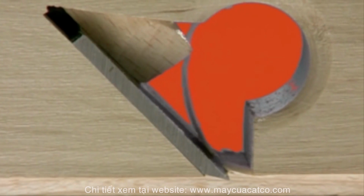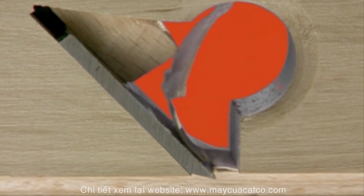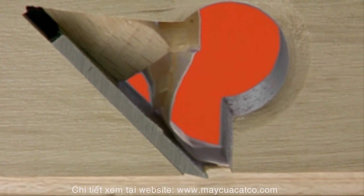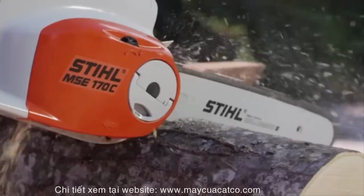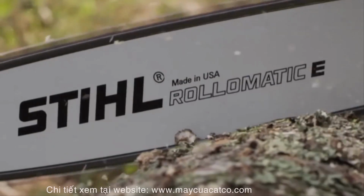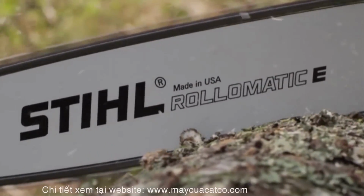The action of a saw chain can be compared with the cutting action of a wood plane. The top plate acts as the plane's iron, and the depth limiter acts as the sole. A section of wood the height of the depth limiter setting is lifted up, sliced off by the cutting edge, transported by the following teeth and then later thrown out. At chain speeds of approximately 60 feet per second, some 500 teeth cut into the wood every second.